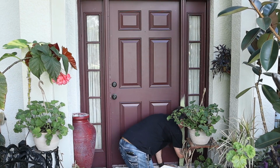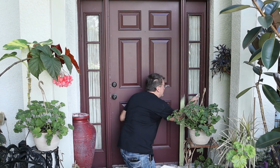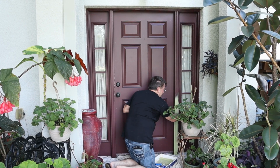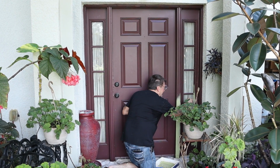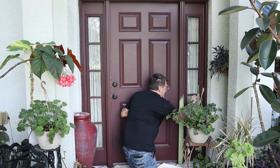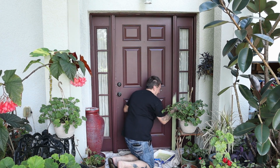So, I'm gonna cut in. Look at this, no tape. If you can see it, no tape. You push it in there and let the brush bristle tips do the work. If you have to go back, who cares? You just want those tips next to the glass. And if you get a little on it, you just get it off with your rag.